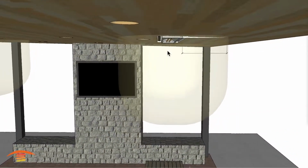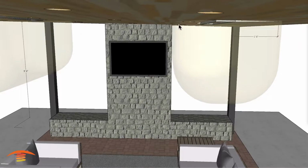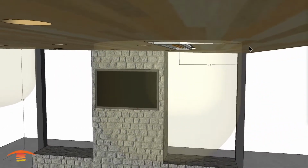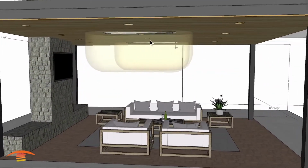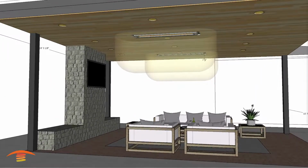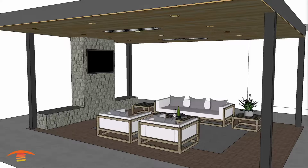level. Okay. And then obviously this side here is going uphill on this left side. So that's not going to be an issue on this side. It's just the issue on the downhill side that we need to have addressed. So this is two heaters, two 6,000 watt units, and I placed them again central within the span of the lighting, basically, so it matches up. And let me go ahead and turn off that clearance below. You can see here that it looks fairly decent, and I'm going to turn off the dimensions as well.